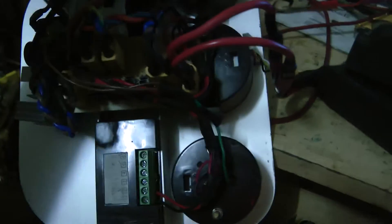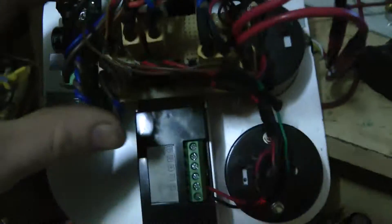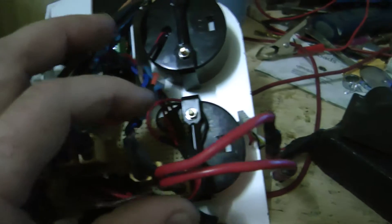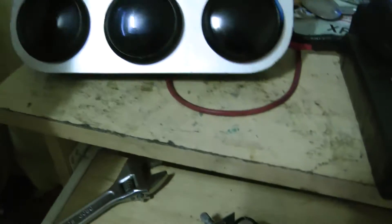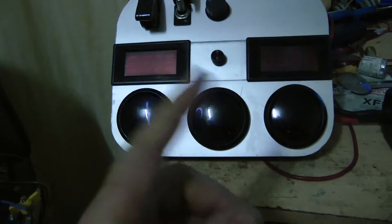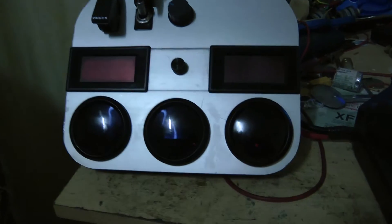All these electronic units, there's a lot of wiring, but you've just got to manage the wiring. To do that I just used the central wiring board which I showed you in my last video — very easy to use. You're better off to use electronic gauges on these jets with a transducer because of the fluctuating pressure; they tend to flutter around and fluctuate.